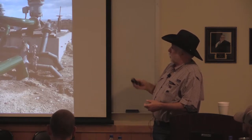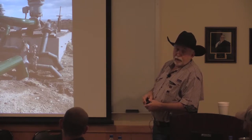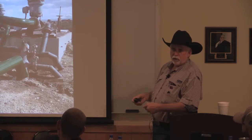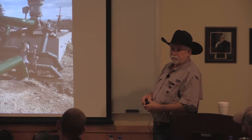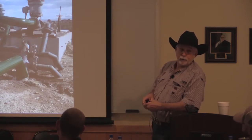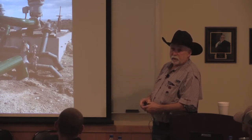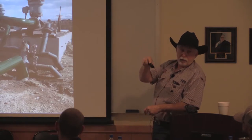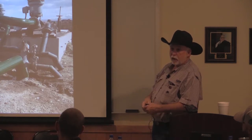And this one actually has two pots more than it needs for the flow that we've got, and that's how you size filters. The dirtier the water, the more filtration you're going to have to have. But on this one, because the water is, well, I'll be nice, really crappy, literally and figuratively, I've set this one up so it never stops flushing. It's flushing the water back to the beginning of the lagoon, so it's recirculating the water, and it has a chance to settle out again.